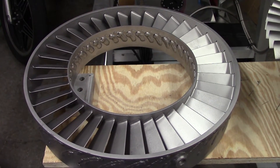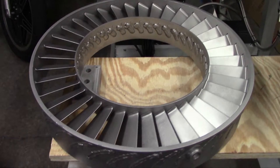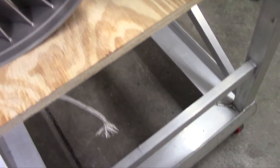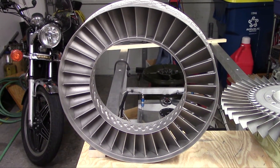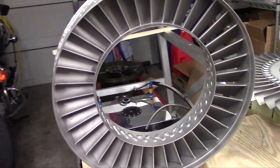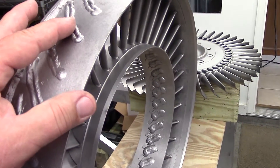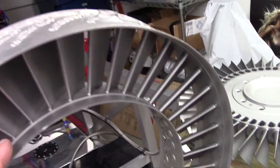Here we have a look at the replacement turbine nozzle and we can see how that really is cleaned up. Let's pick this up here and look at the back. This is the side that faces toward the front of the engine toward the combustion chamber. You can really see all these welds - each one of these vanes is welded at the outer ring and it's welded here at the inner ring.